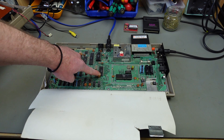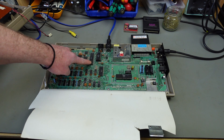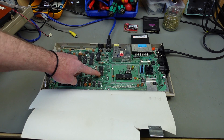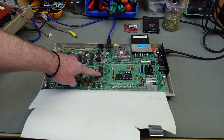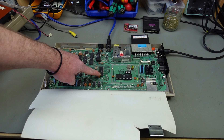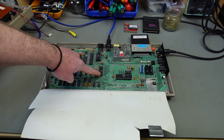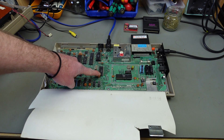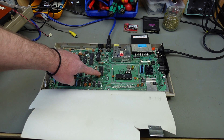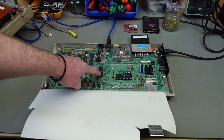The dead test not working means there could be quite some things wrong. I suspect the PLA or the processor. The later revisions of the PLA are usually pretty reliable — not the most common thing to fail. The first revisions of the PLA chip produced by MOS had some chemicals wrong in the insulation layer — too much boron — and basically the chips ate themselves over time, damaging the die internally. These later versions don't have that problem.